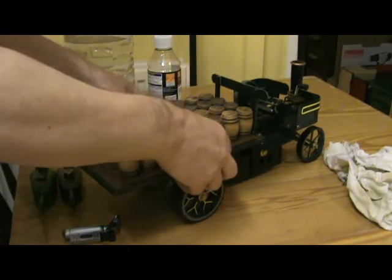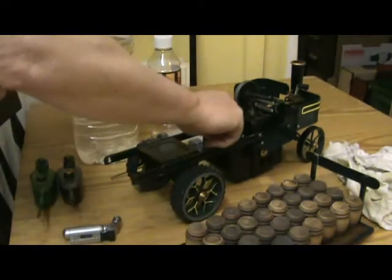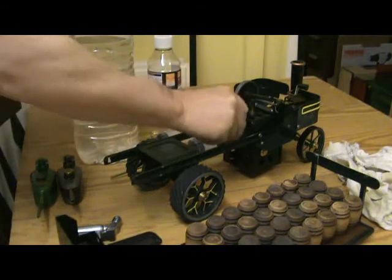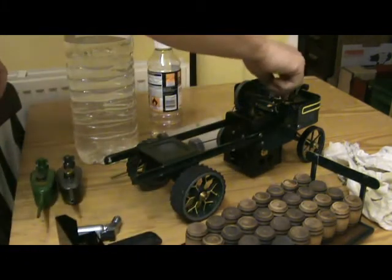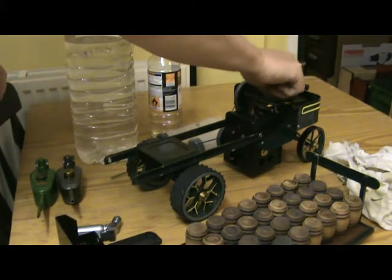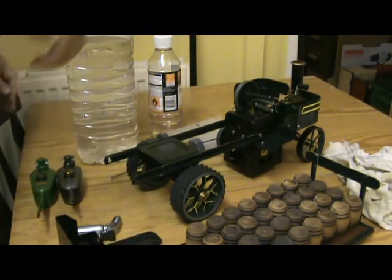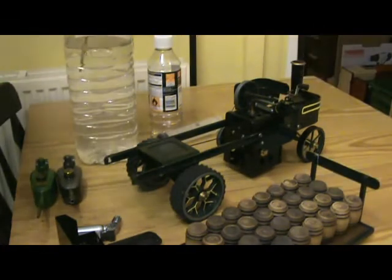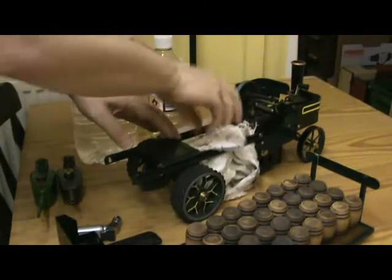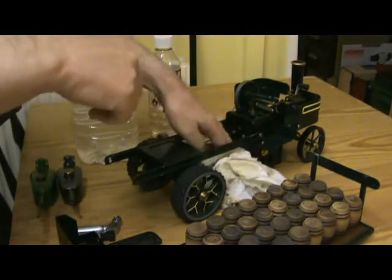Okay, in order to steam this engine, you have to remove the flatbed to gain access to the burner and the overflow plug. Safety valve is in the usual place. Before I put any water in, I usually put a rag underneath the overflow plug to catch the overflow.